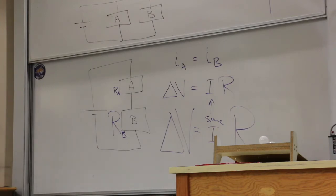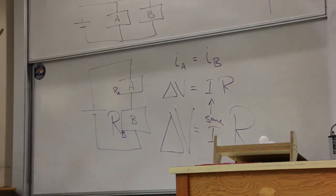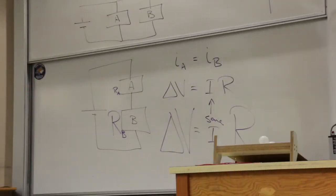Now, here's what the student is saying. If A and B each contain a single bulb, A is going to get more current, so it'll be brighter there. A is going to get less volts here, so it's going to be dimmer there. That's contradictory. And the problem is assuming that both of those boxes can each contain one bulb. If we're dealing with identical bulbs, and each box has one bulb, both boxes have the same resistance. Okay? Now,